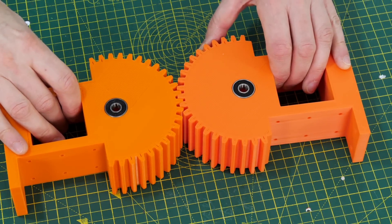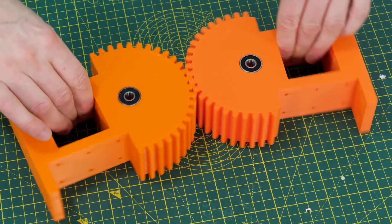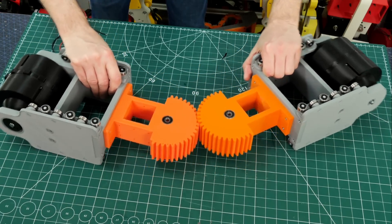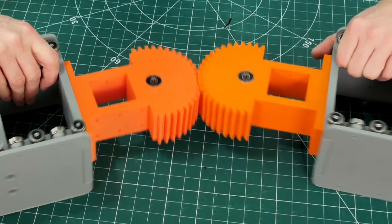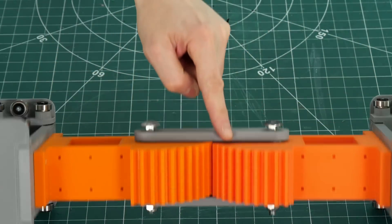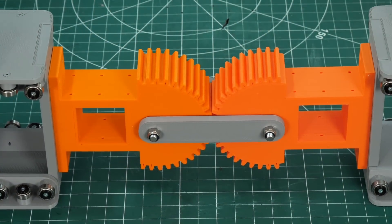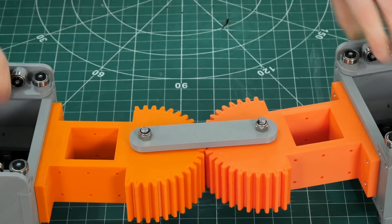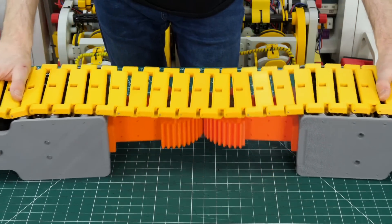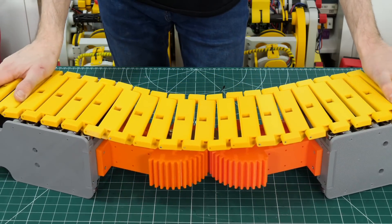I'm using two partial gears which rotate against each other, with bearings top and bottom giving two pivot points spaced apart instead of just one hinge in the middle. Bars with 8mm bolts and lock nuts hold the whole thing together and keep the gears aligned. When the track is on, we get multiple bend points where those two bearings are, allowing the track to bend smoothly.